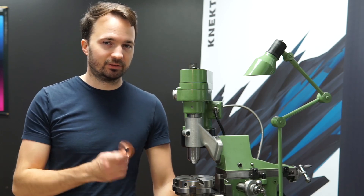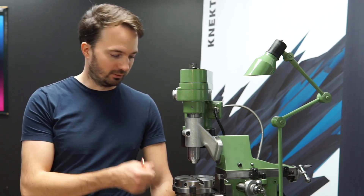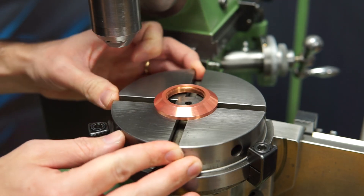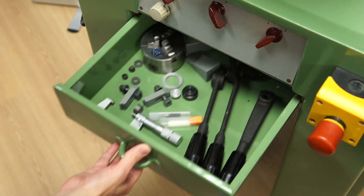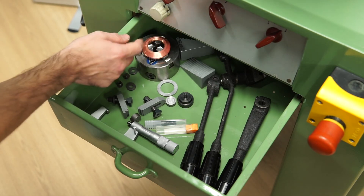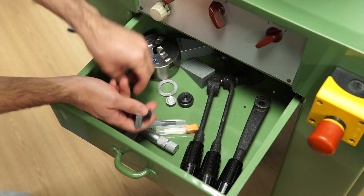Hello, I'm Jack and in this video I'm going to continue with my watch case. Since I already set up this machine in my last video, there are just a few things we have to do before I can start milling. It needs to be fastened and clamped, and it needs to be centered on the table so that when this rotates, it rotates around the center of the watch case as well.